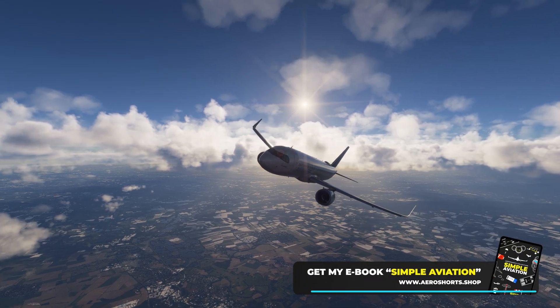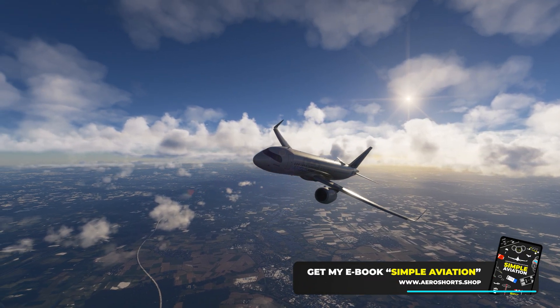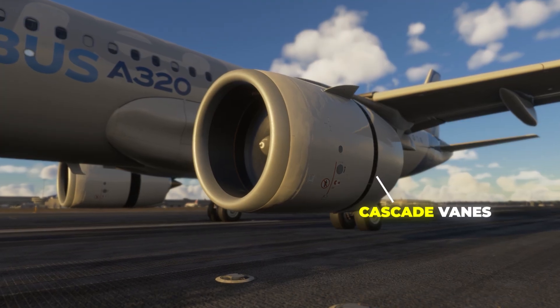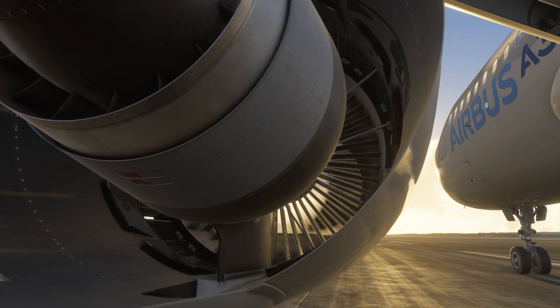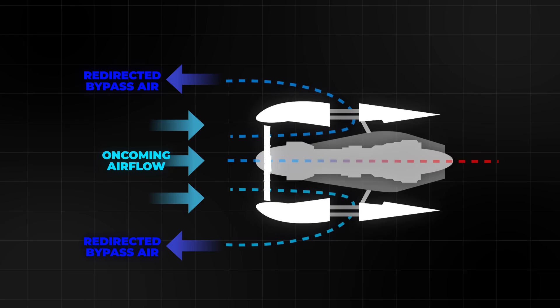Here is a simple idea. In normal flight, air goes through the engine and exits to the back, giving forward thrust. After touchdown, the pilots pull the thrust levers into reverse. Then a sleeve on the nacelle moves backward and opens cascade vanes on the side. At the same time, blocker doors inside the bypass duct close the normal exit path.